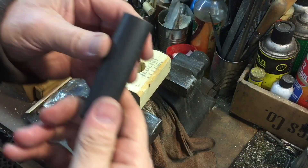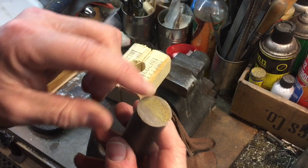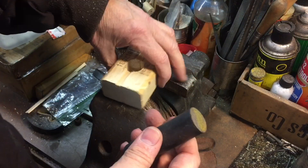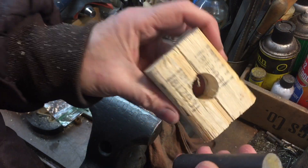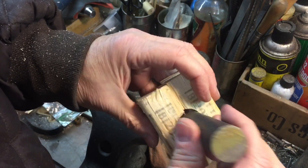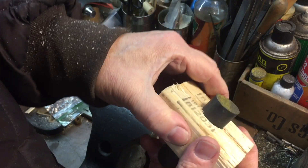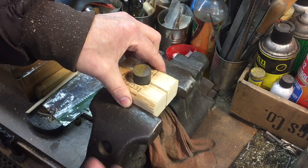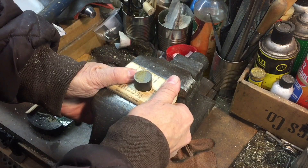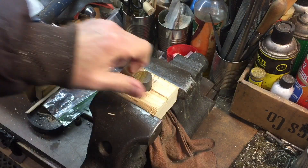So let's give these a test. Here we have a piece of one-inch cold rolled steel — I probably cut it off at one time with a hacksaw or something, it's a little uneven — but this is a perfect thing to try out the files with. I drilled a one-inch hole in a piece of two-by-three, then I sawed it in half. This makes a great holder for the vise, because it's a little difficult to hold round stock in the vise. We'll put it in great-grandpa's vise and use this as our testing piece — you can see it gives a real nice hold on that piece of steel.